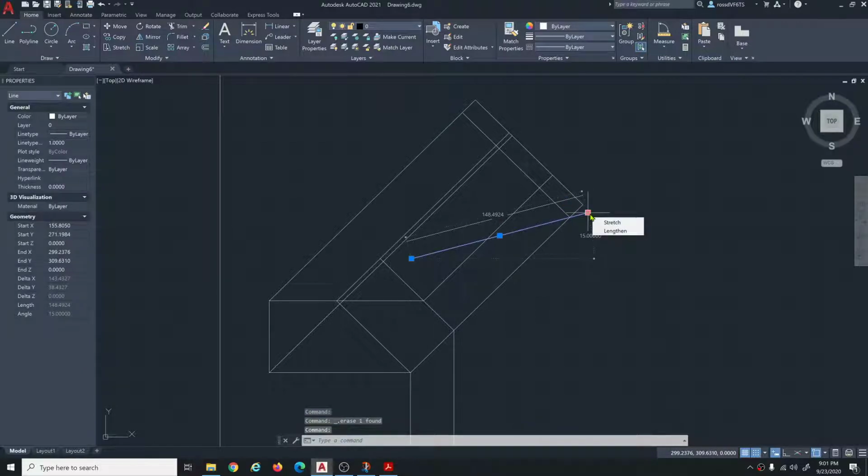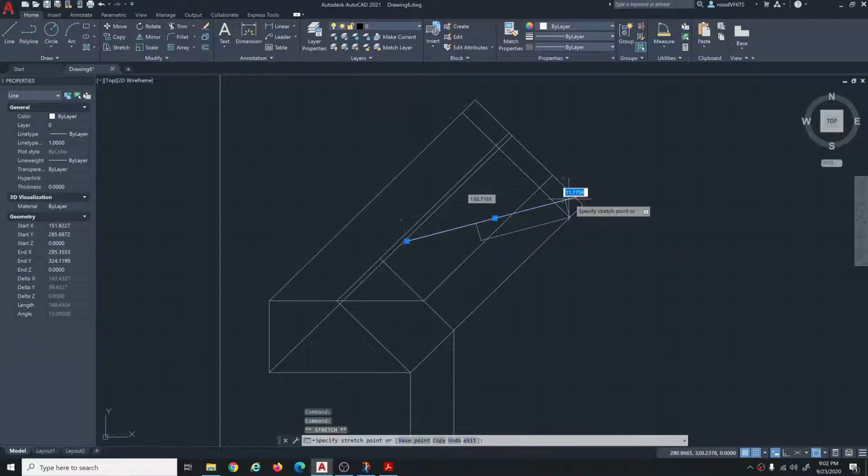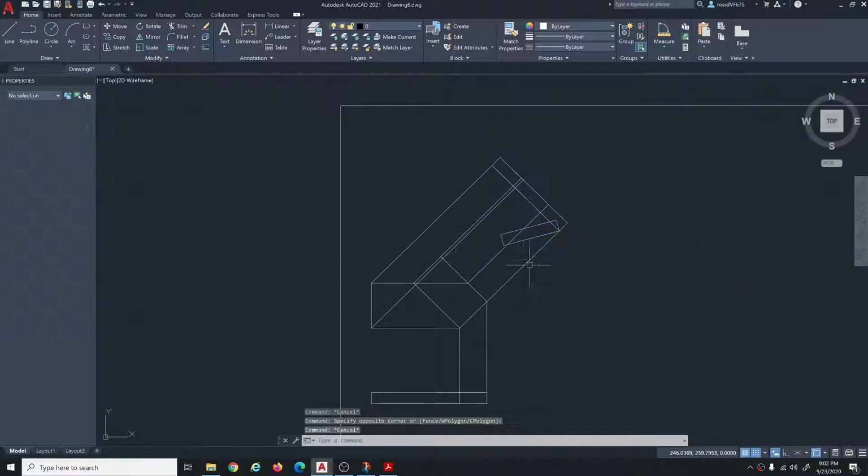Look, if I take this guy and move it back to there, and then change the length to 75, use the length command and then tab and then 75. That line right there, 75, because like I was saying, these two lines represent the flange, the edge of the flange in its true shape. So I can finish that off now. Basically, this little rectangle that I just drew, let me clean him up. That's these four guys, that's the flange. It's 15 millimeters thick and 75 millimeters long. True. Okay, now I can project back from the first auxiliary and finish up the top view, all right?